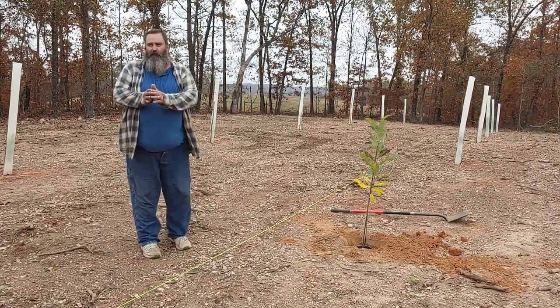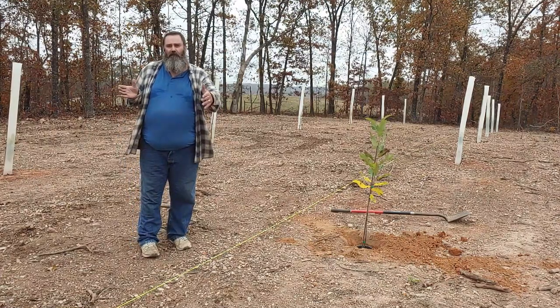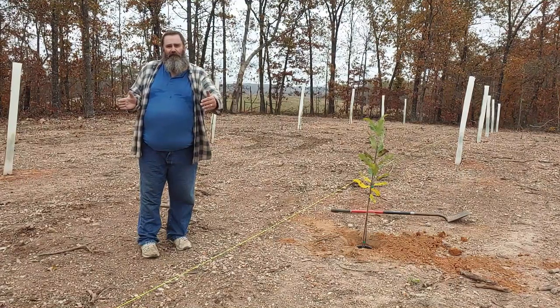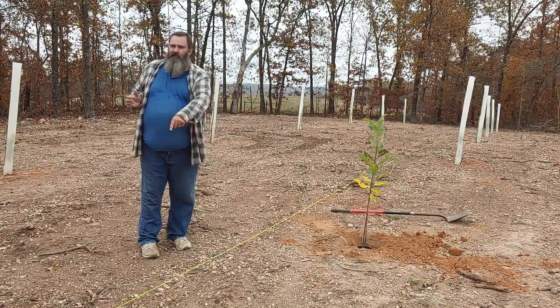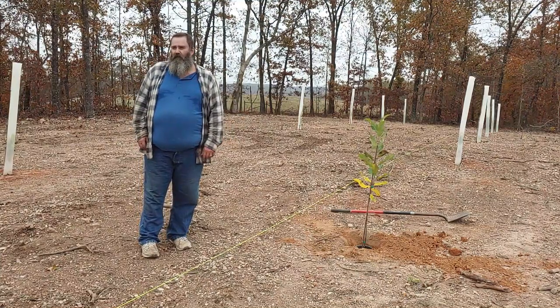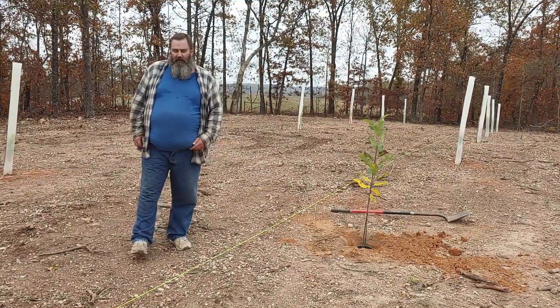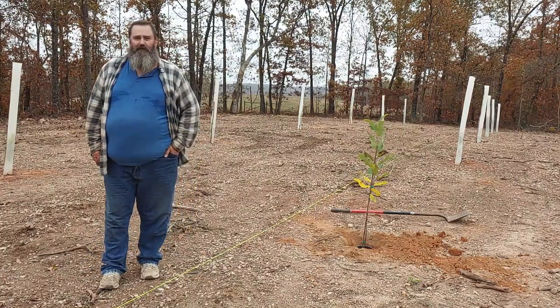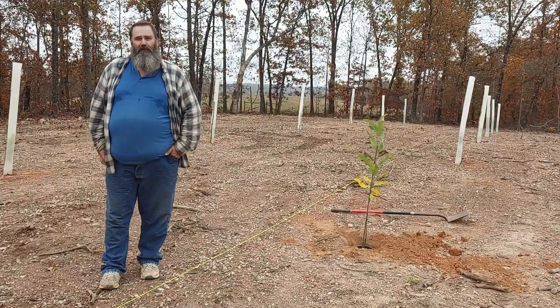That way it would make up for the width of the tractor, because the outside of the wheel to the center of the auger is 3 feet. So I can just follow this string line down and drill a hole every 20 feet. And that's what we're doing today. And we'll show you some video of that as we make some progress. So come along and enjoy the video.